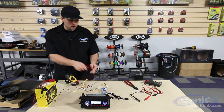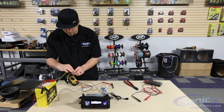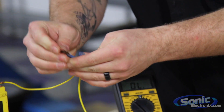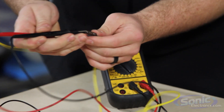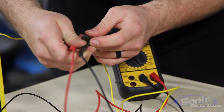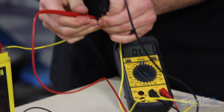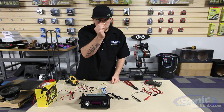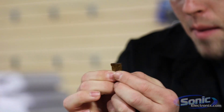Now if it was blown, one easy way to check — I have a blown fuse here, completely popped it — we'll replace it with the blown fuse. Now we'll try to check continuity on the fuse to make sure it's not blown. See here, we take the same test leads as before — doesn't matter which terminal on the fuse — and you'll hear no beep. That's basically telling me that we have a bad connection through this fuse, or it's completely popped. As you can see, there's a little brown mark in there, which shows me that the fuse is popped.